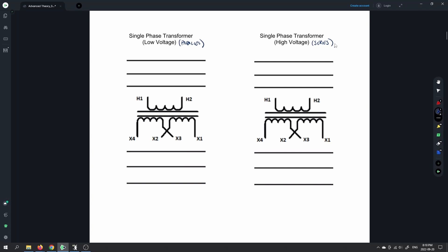In all the other videos I've shown, as you're wiring these up we're obviously trying to be as safe as possible using touch safe jacks. When you're taking meter readings, you'll see in the videos that follow that my hands are never in the circuit — I'm using touch safe leads and never putting my hands into the circuit, so I don't need high voltage gloves.